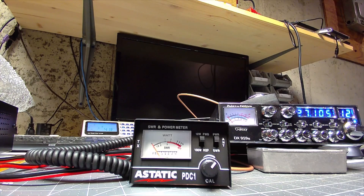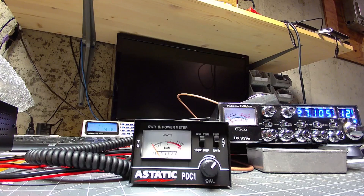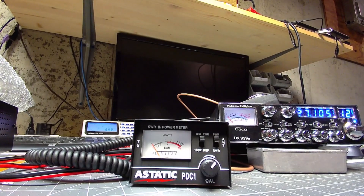If you were to go to 200 watts, the receiving station wouldn't even notice. If you went to 1,000 watts, the receiving station would notice. Your first 10 dB makes all the difference. So let's not get too wrapped around the axle of being a watt off or something. All we really want to know is: does this meter swing to about where it should be with what this radio is advertised to do? If it doesn't, this meter did its job — there's a problem with my radio.